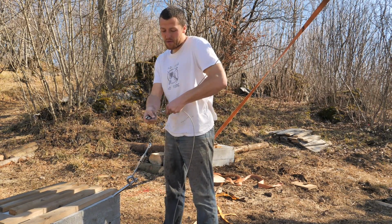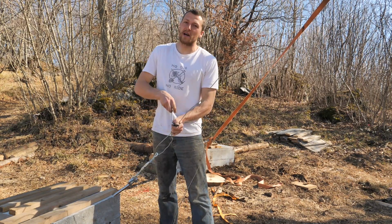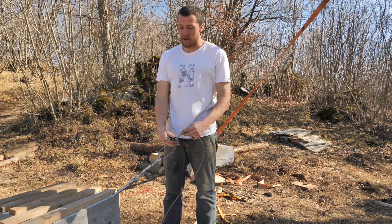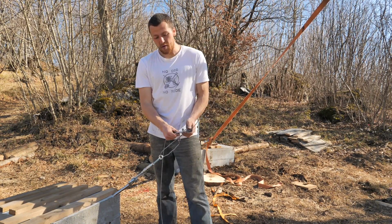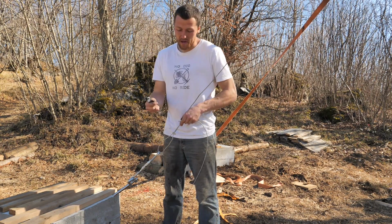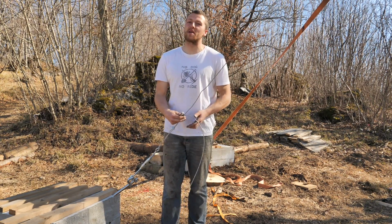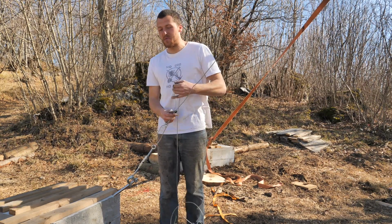So now I have to do a knot at the end, and someone warned me about the cable sliding out under the comments of the last video. No matter how many of the blocking clamps you use, if you don't do a knot going back through the bolts and then under another clamp, the cable, when it's under tension, will just slide out. So luckily I saw this before I even started lifting up the logs. Otherwise I think this would end pretty badly.